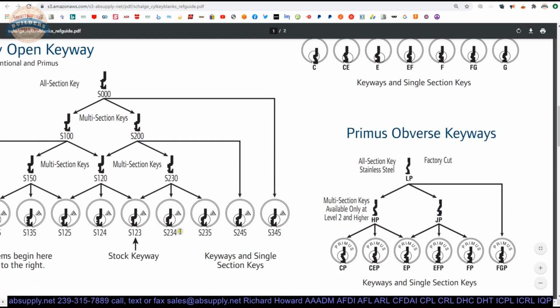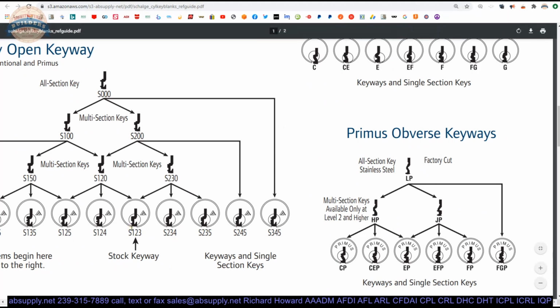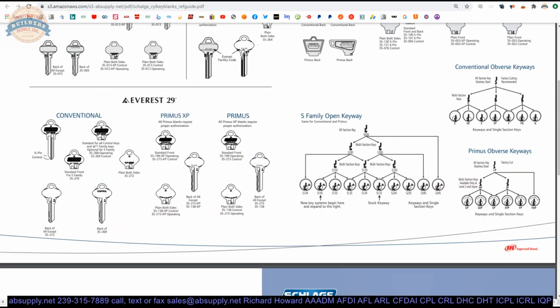Well, if you evolve it to an S keyway, where there are not a lot of S keyways out there, while the math is still the same, even though it's a 6-pin system, which that number is going to be 4096, 1 out of every 4096 will theoretically work. If you have your key and you go to 4097, one of those is going to work. That 4097th lock is guaranteed to work, mathematically. But when the keyway itself is so rare that you don't encounter these, you have a substantially smaller amount of reason to be concerned over random keys working your random locks. Plus, with that check pin, it makes it more secure in today's environment of picking and impressioning and 3D printing and bumping. Okay, let's wrap up this video on camera.